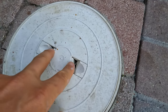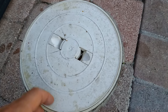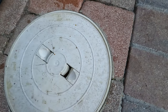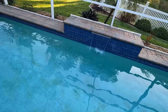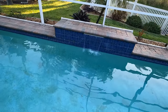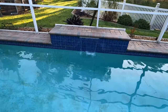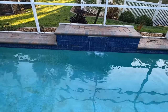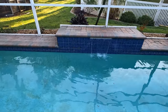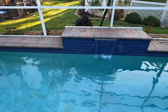This skimmer lid's spring action is broken so it doesn't really lock - it lifts up at your leisure. Looking at the waterfall, you can see it's not flowing 100% normally. That's grains of sand or something stuck in there - that's an easy fix. Just to the left, along the waterline, if you look close enough some pieces are out - that is starting to fail.